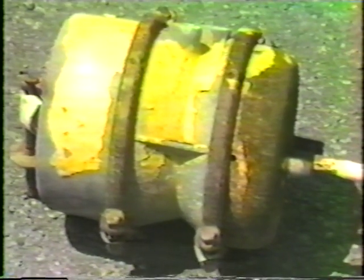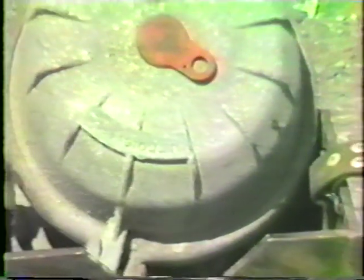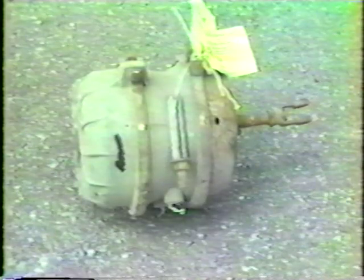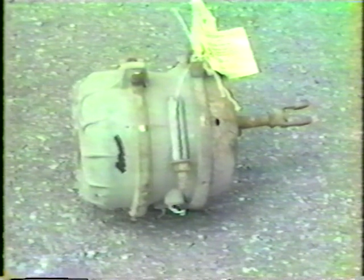The contour of the Wagner cover is cylindrical in shape. This is an Aeroquip Maxi II model — the second product experiencing an internal corrosion problem. It has the Aeroquip name on the end cover, cast fins on its exterior, and locking ears on its sides which wrap around the clamp band bolts.